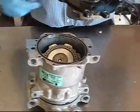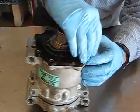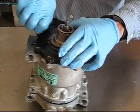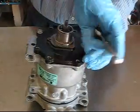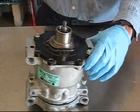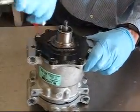Take your front head plate, noting your marks from earlier for which direction to put it. Set it down — you will notice it does not sit flush; it wants to sit tilted because of the angle of the crankshaft. Go ahead and start your front head plate screws. Torque is normally about 23 inch pounds, or just tight — this is not a real critical tightness. Tighten it down and it will pull itself flush. Go slowly; if it binds, stop. Sometimes the head plate will shift a little aside — you may need to tap it back. Make sure that O-ring did not pop out of the gap and cut.